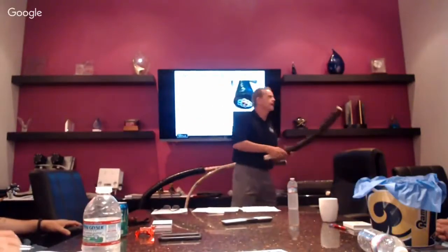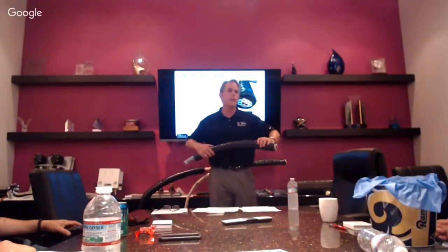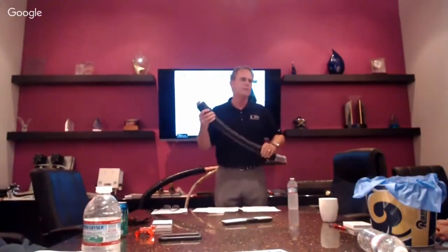This is a different type of bundle. This is a poly line. The Perlick always puts in their Century systems the copper lines. And some of our competitors say, oh, they're outdated. Poly lines are just as good. And they're easier to install. They're a little easier to install, but these are still not all that flexible. They have filament tape, barrier tape, and then Armaflex around it. So these are still very tough to get them through. The insulation is a little bit thinner.